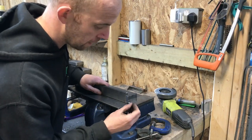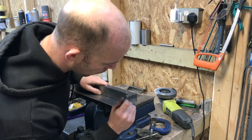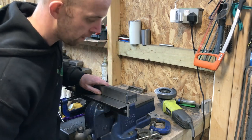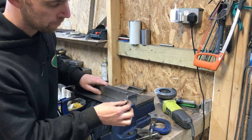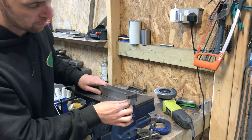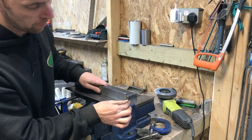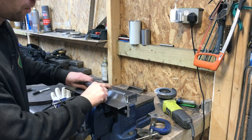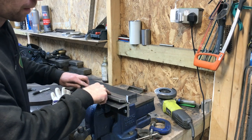The next bit I'm going to do is drill a hole — that's five mil in and five mil up from the bottom there, and that's going to be my centre point. I'm going to tap this plate and that's going to be my pivot point. In theory, once we've got a bit of metal in there, we'll then be able to create a 90 degree bend.